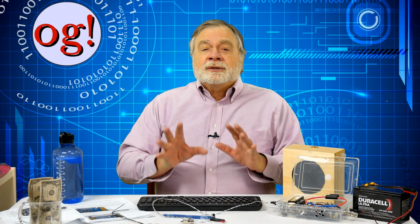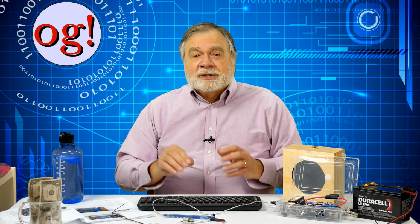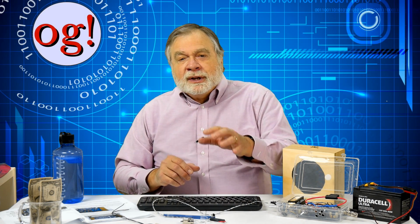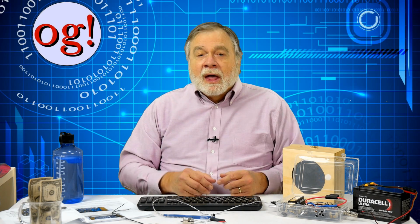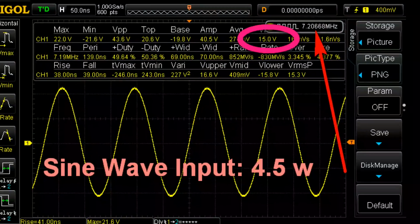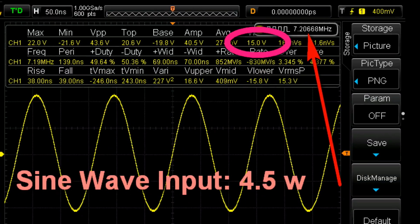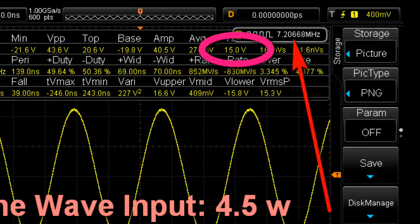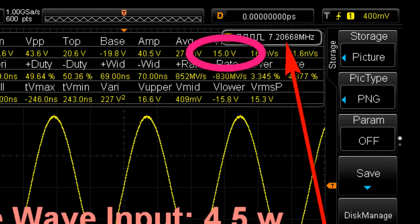I've heard that others have had similar issues with their BITX-40s, particularly when the kit was recently upgraded from a traditional VFO to the Raduino VFO. I'll follow these issues closely. By the way, the scope's frequency counter closely matches the display readout, so I don't need to go through the process to calibrate the Raduino.